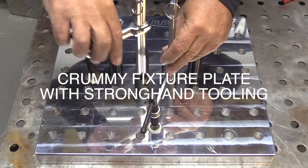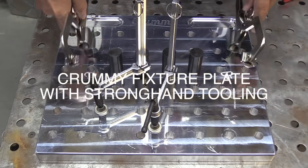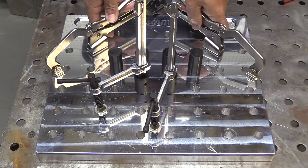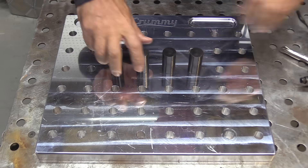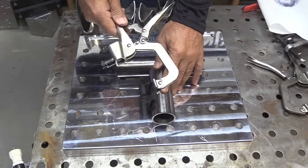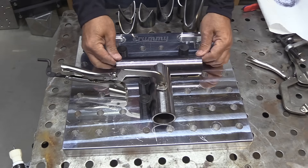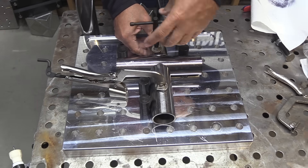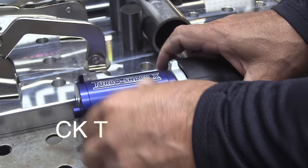This is just a practice cluster joint 4130 kit, but it's very representative of a lot of stuff that I've done in a side hustle job. A fixture plate like this — something to get things at a square 90 easily and to hold things and then you can spin it around on your main work surface — is one of the handiest things I've ever used. It'll let you clamp something at a true 90 degrees in just a few seconds.